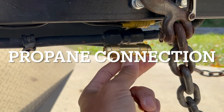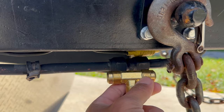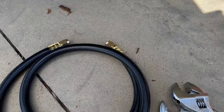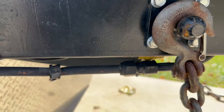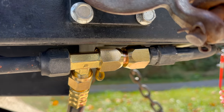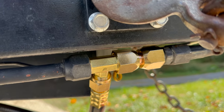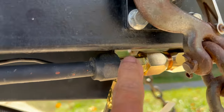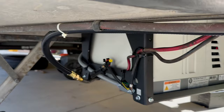For the propane, I needed a T-fitting right where the main propane line comes down, going down to a half-inch flare off the side. I think these are both five-sixteenths and a half. Essentially this T is off and I have a propane line that goes down and feeds the male end. I'm using a female-to-female adapter on this side. Here's the propane finished: from the right, the male end comes in from the main propane tank. It goes into a female-to-female adapter — five-eighths to five-eighths — and then into a T that is a five-eighths, five-eighths, half-inch T. That keeps my regular propane going straight through, and I just teed right off — zip-tied and cleaned up, going right into the generator.